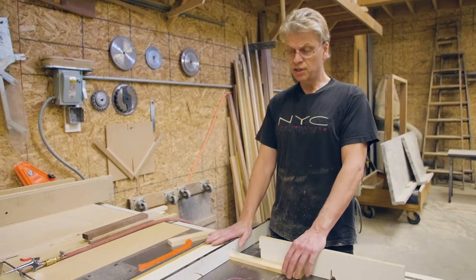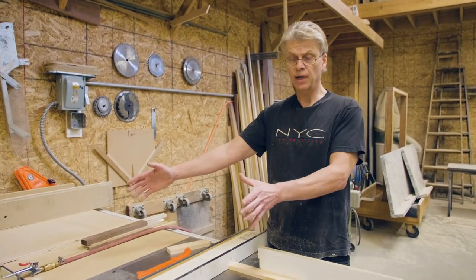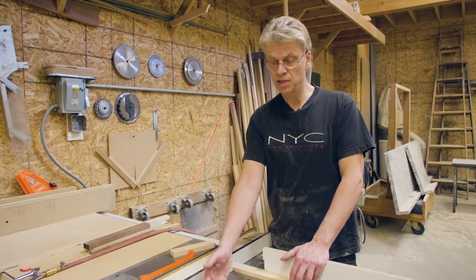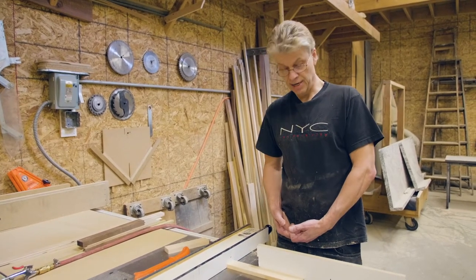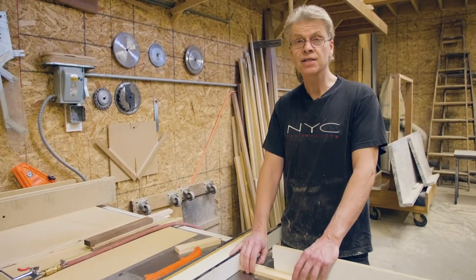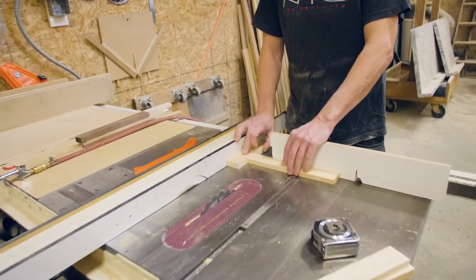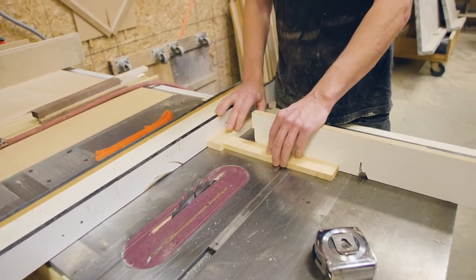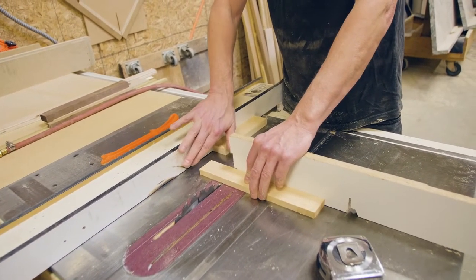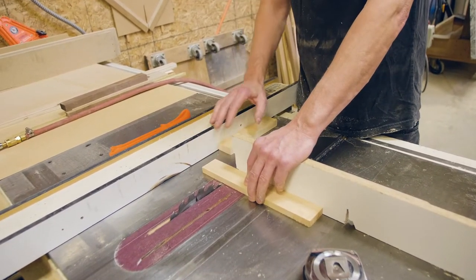Many years ago when I started in this industry, I worked for a factory, and I was cutting off 2x2 foot plywood panels, and we did not use this technique. And this piece kicked back and hit me in the groin right here, and I had a blood blister about like that. I stayed out of work for like 3 days, but all of it could have been avoided by using a block such as this, because when I use this block and then we cut off this piece, it's free, it can't get jammed. And so just with my finger, I'll take it and move it away from the blade, and it'll be very safe.